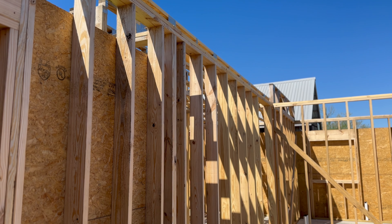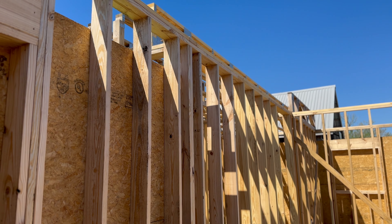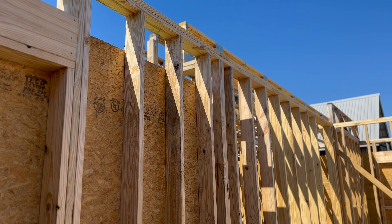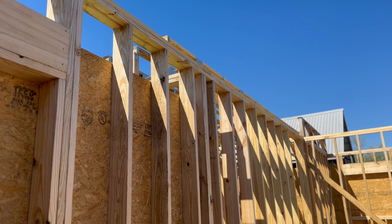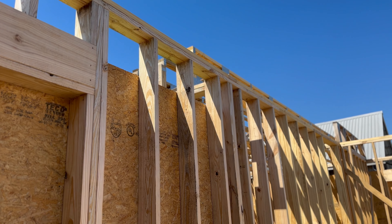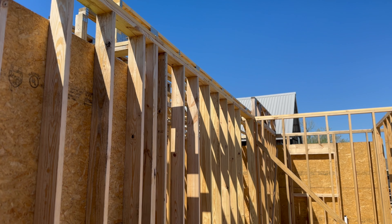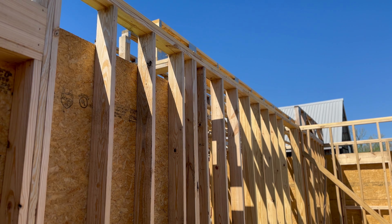It's a hot Texas day in February and we're gonna just try to get something done with the house today. I'm gonna go ahead and cut some short studs to go on top of this wall — it'll be for a knee wall. We'll put on top of this double top plate a stud for each of the studs that are here, and then double top plate on top of that. That one truss that's back here will come off and this whole thing will just be a knee wall.